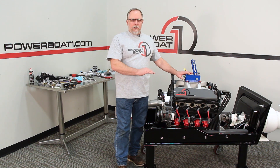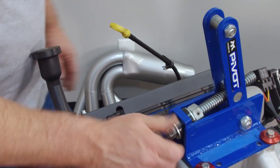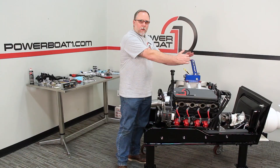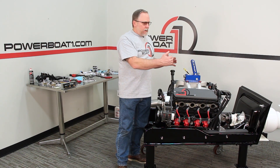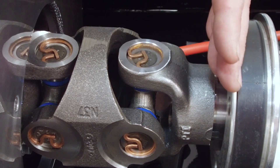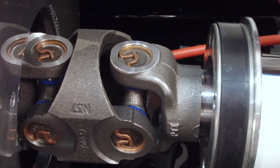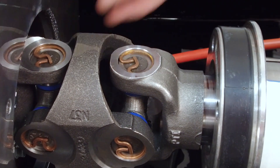The way we go about getting this in and setting the rails is I use this max pivot, which is really nice because as you spin it, you can actually change the degree of the engine. We slid the engine all the way back on the pump until it stopped and then brought it forwards about an eighth of an inch, and that's where we wanted the engine to set. The first line is when the engine was all the way back; the second line is where we moved it forwards — that's where we wanted to sit on the spline, so that as the pump shaft moves around, it's not going to push on the back of the crankshaft and push on the thrust bearing inside.